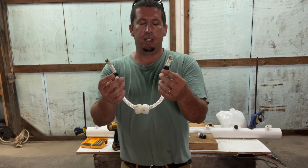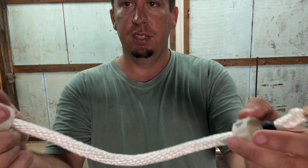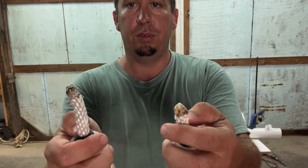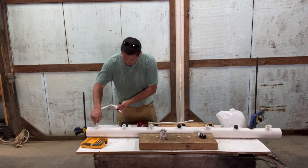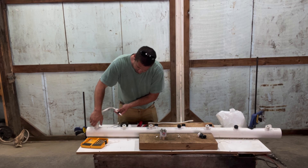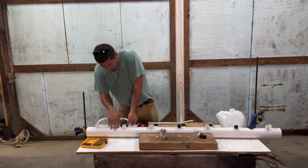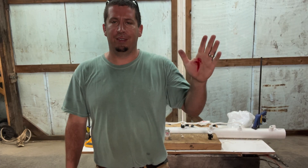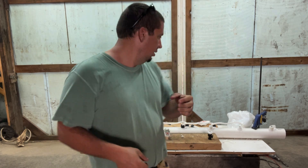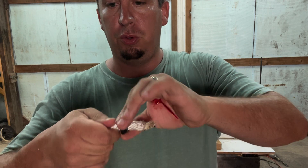This is what it looks like when you get it done. You have your two compression fittings and then your two caps that slide on — tighten those up, stick this in down in, put the compression fitting in, tighten up. Pro tip: don't use a screwdriver to push that in. Here's how you do it — get one started and just twist, it will start. Don't end up fighting it.